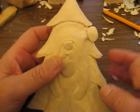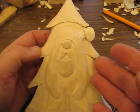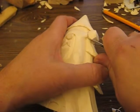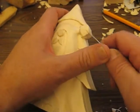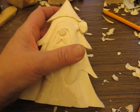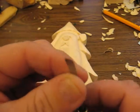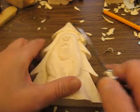So what you want to do is you want to have all this — basically each corner you want cut up. And here too, when you start cutting this up, you're going to cut underneath this tassel and you're just going to slice it out. And you make it a little deeper all the way around here. I'm going to find a little scoop — I use one of these little tiny palm gouges to get up in here.